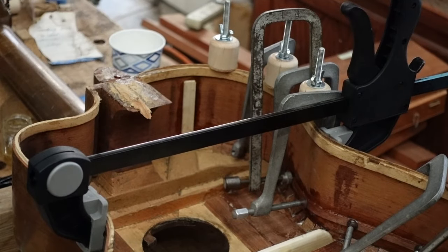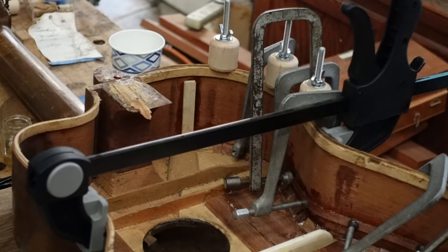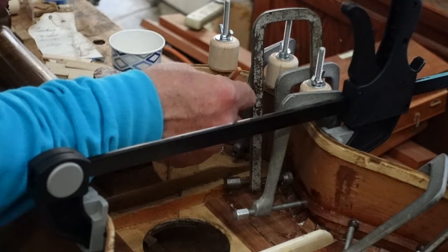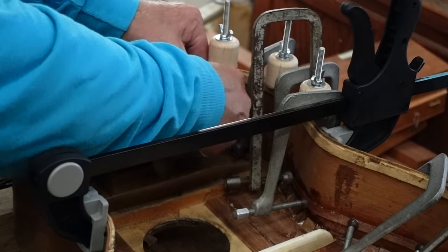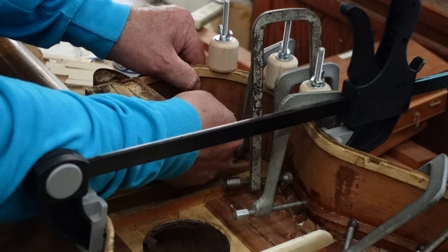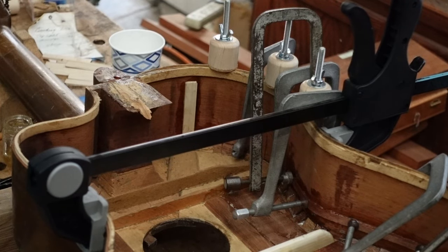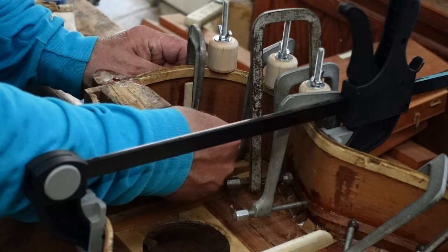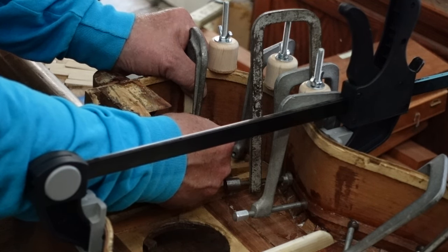There we go. Okay, we've got a handful of these side braces, cleats, struts, whatever you want to call them. And we're just going to go around and get some hot hide glue and kind of strategically place them, glue on the side of the guitar as well as the back, like so. If there's any cracks or anything like that, we'll place those strategically, and then we'll take these clamps here. Are incredible. Violin makers have some. We don't have enough, that is for sure.